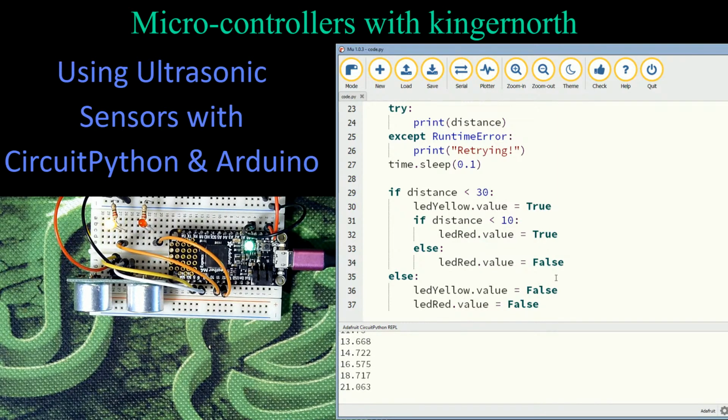This works great with a single track that's coming to a stub end. If you're going through a pull-through staging yard, this is not good because the sensor would be in the way of your train pulling out. So that doesn't work. That's where the infrared just says, I'm positioned here, I'm positioned here.